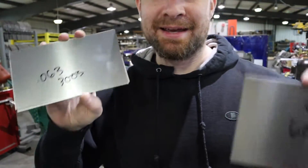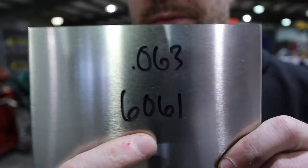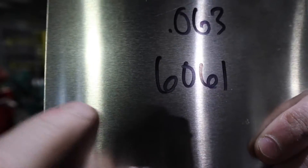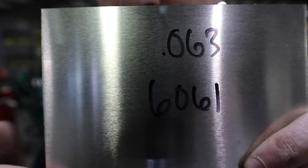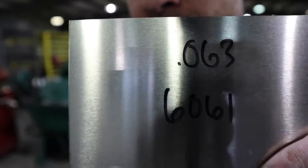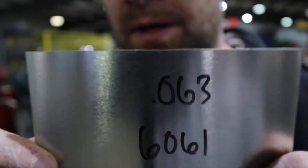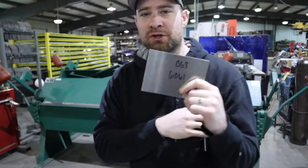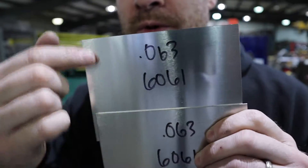The difference is in their strengths and flexibility. When I go to bend these, especially with 6061 aluminum, as you get in close you can kind of start to see this grain structure — see how it's going within one way of the sheet? When you're bending, especially 90 degrees on an apron brake, you want to bend against the grain. Because what's going to end up happening is it will crack on one side. I've got two pieces and I'm going to bend them both ways — one going with the grain and one going against the grain.